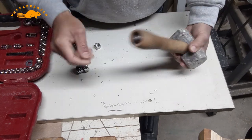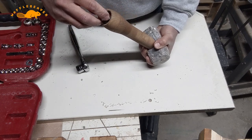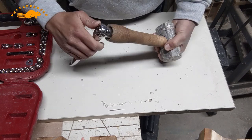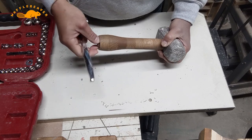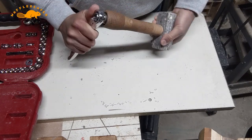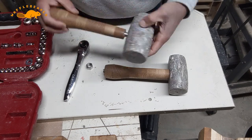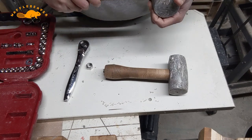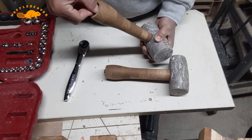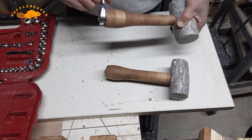I used Forstner bits with the drill press to fabricate more holes in the handle and mallet head so the stainless steel hardware would work — apologies for not filming this part. This is how the mallet handle and hardware get assembled together. I made two versions: one with the bottom of the head cut flat and one completely round. Mallets are just things to hit stuff with — this is not a technological advancement — but having a nice mallet with a smooth handle does feel nice and adds just a bit more joy to hitting things. I hope you enjoy this video, please leave me a comment if you have any questions, and if you made it this far please like and subscribe — thank you.